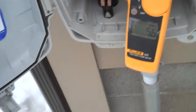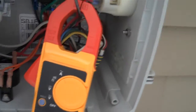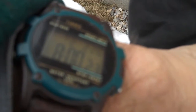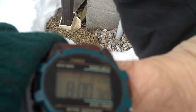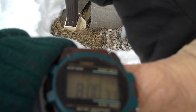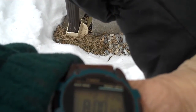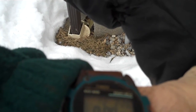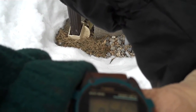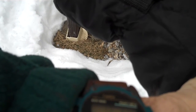The alarm has gone off. If you notice the current draw on his pump, it's 5.6 amps — that's perfectly normal. Now if we measure the pump-down time on Gunner's pump operation, it's quite long.